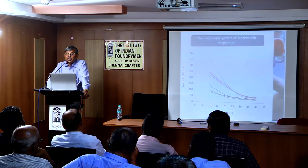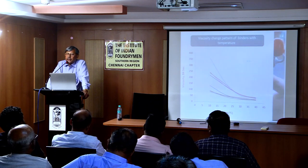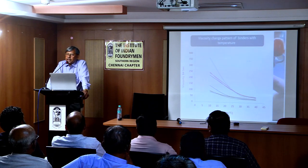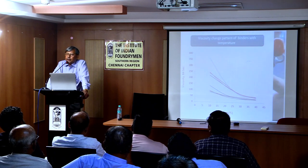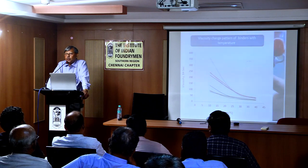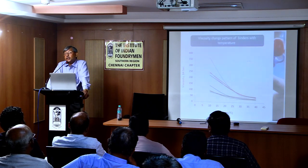And next, there is a term called cloud point. I think that term is not very common to you because you never face it in tropical countries, but in cold countries, at a particular temperature, the resin loses its transparency. It becomes opaque. It develops opacity, and it is basically phase separation. Solvent and resin are not miscible. So whenever the material becomes opaque, it indicates some faulty formulation, and even in tropical countries, at 30 degrees also, once in a while it happens.